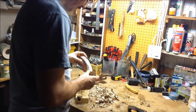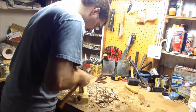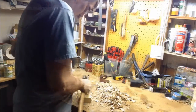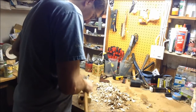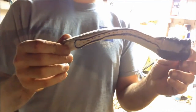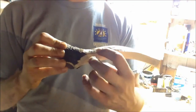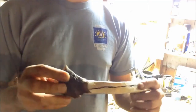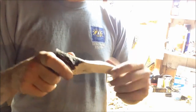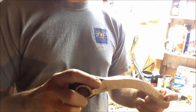We've just been continuing along with the hatchet — it really does make pretty short work. We're getting a little bit closer to the handle shape dimension. Now we'll remove this material under here. Actually, before I tackle this part, I'm going to start to rough out the bowl, just so that this piece of wood has some mechanical strength left from when I'm hammering on it with the hatchet. I don't want to break this. So I'll leave this until a little bit further along.